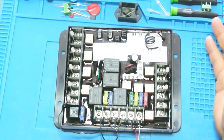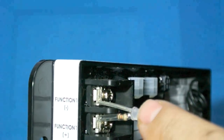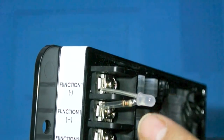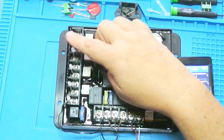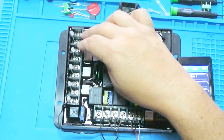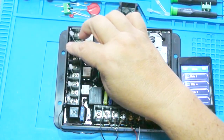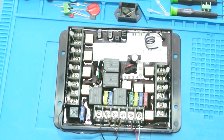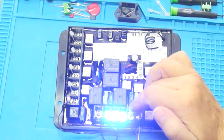The external switch power provides manual control from the console in your RV. To make things visible, I've attached an LED to each channel. These LEDs are bi-directional — with positive and negative in one orientation they glow green, and when flipped they turn red. This tells us whether the motor is going forward or reverse, since a DC motor changes direction based on how positive and negative are wired. When we power up the board, three lights come on — two fused and one unfused — powering the console switches.